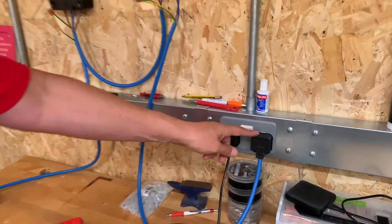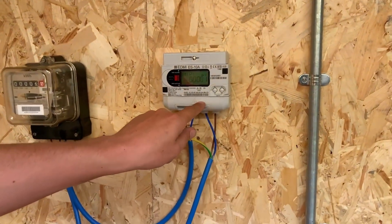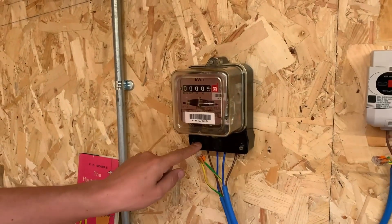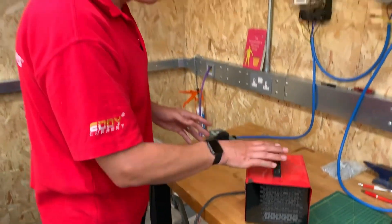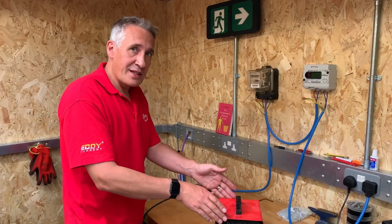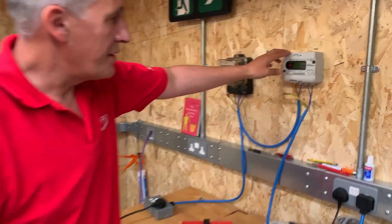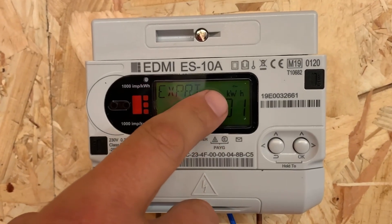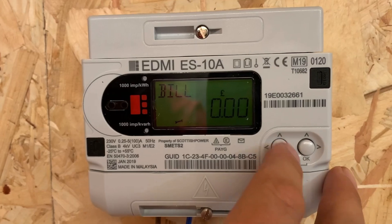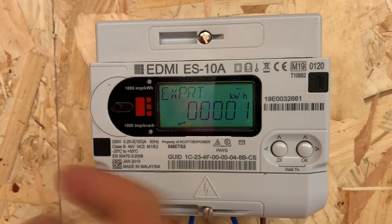Imagine from this socket here — this is the wiring from the property — and now the power is going in to what was the output of the smart meter, then flowing back out to our analog meter, and from the input side of the analog meter I've connected the fan heater, which is now functioning as if we were dumping this into the national grid. We can see that the smart meter, if I just switch the heater on, has a little flashing arrow that indicates power is flowing back out of the property, and it's already registered one kilowatt hour of energy flowing back out.